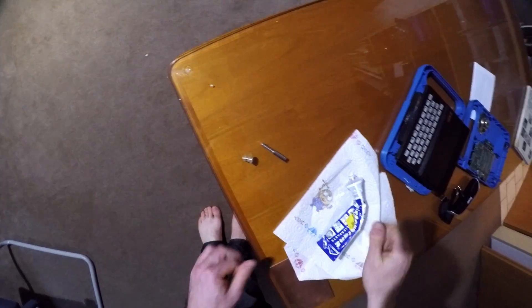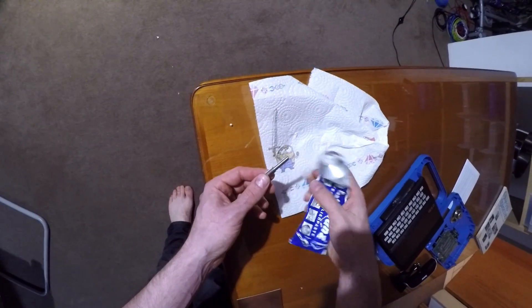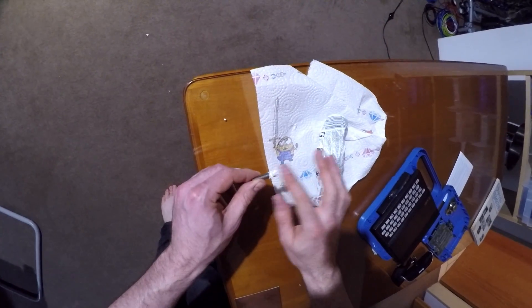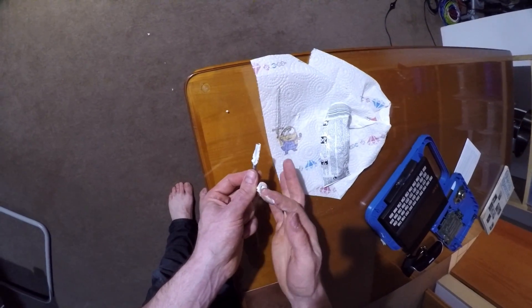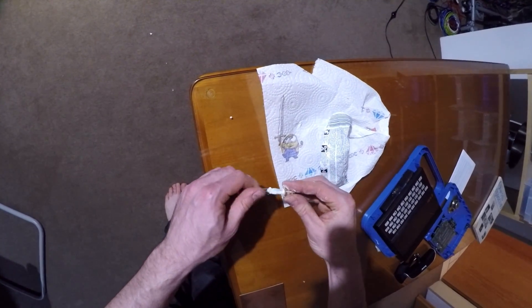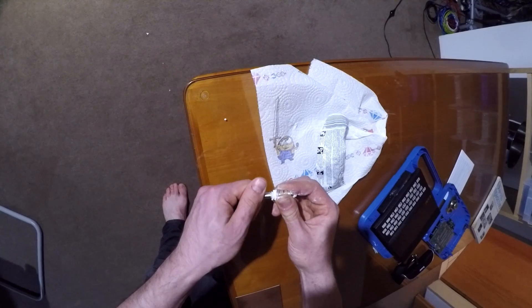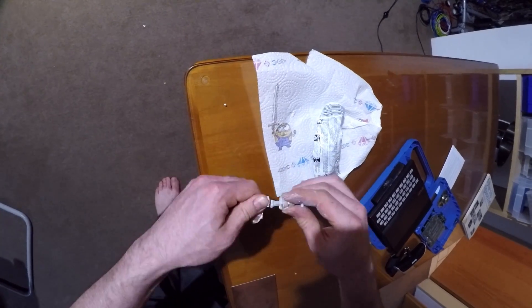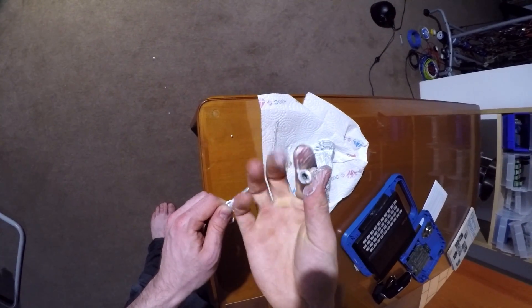The immobility of the potentiometer knob clearly came from the fitting of this extension rod in the lockable brass bushing. A bit of penetrating oil did not help at all, so I used this crude but effective automotive valve lapping technique. I applied some metal polishing compound to both parts and now I'm just rubbing their surfaces together to polish out any high spots. With the polishing compound getting lightly gray, we can clearly see that this was a success.